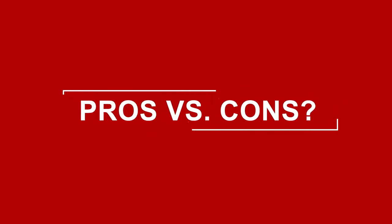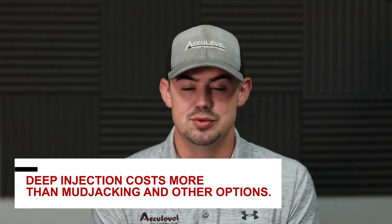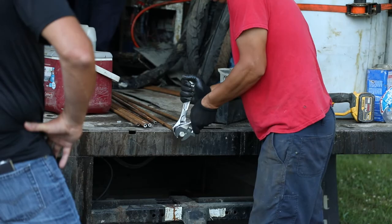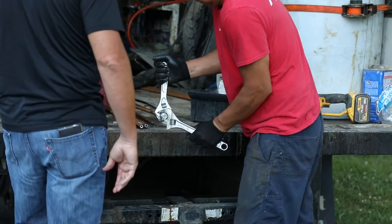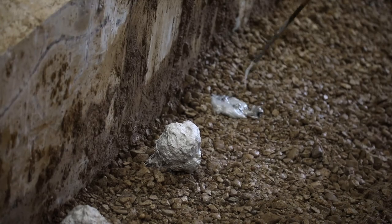So what are the pros and cons to deep injection? The con to deep injection is really the cost. This is a more expensive option than, say, mud jacking or injecting limestone material up underneath a slab or a structure. But the big pro is that you're able to get this foam much, much deeper into the ground, therefore improving and stabilizing the soil while utilizing it.